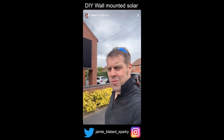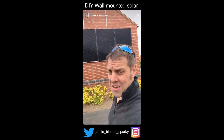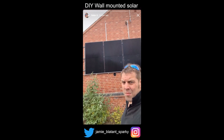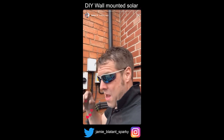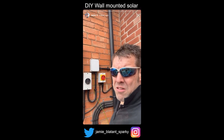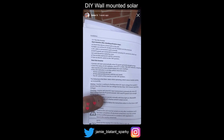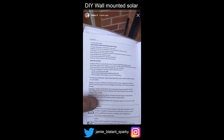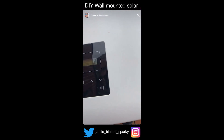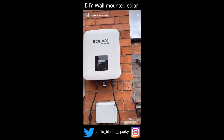I am the new king of solar! I'm going to turn it on now — we've been on this journey together and if it blows up you'll get to watch me cry about it. Not bad for about 10 hours total work, though about five million hours prep time. Hold on to your hats. It fired up — according to the manual it waits until it gets 80 volts on the string to start up and 100 volts to run. Obviously there's no sun at the minute so it's making absolutely nothing, but it's checking — 42 seconds, 41 — something's going off!